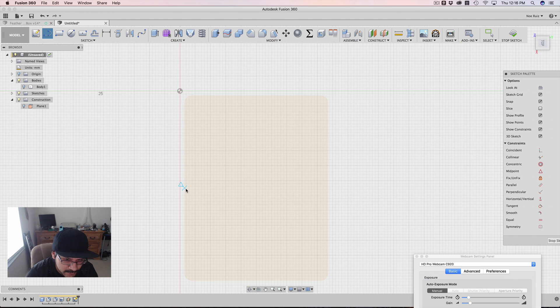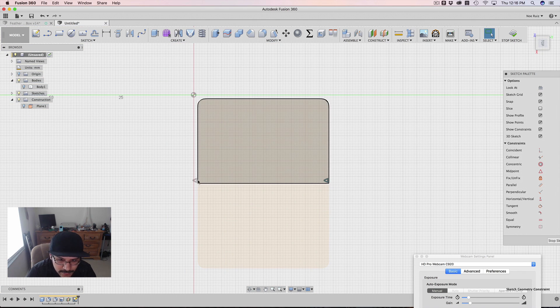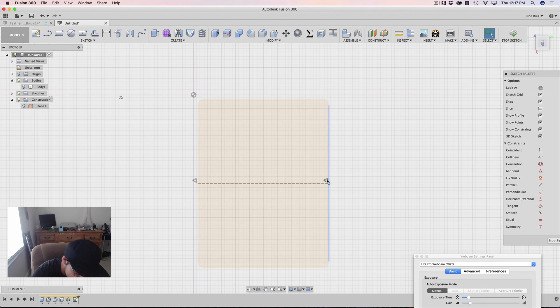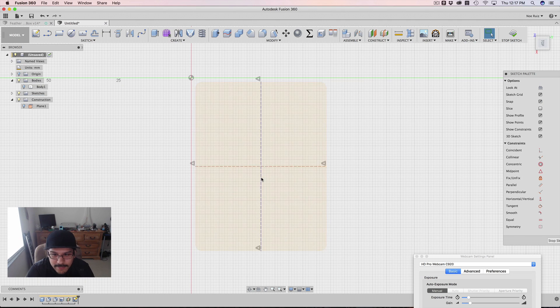It locks into place and gives you a little playroom. Once you see the triangle, that lets me know it's a midpoint. I'll click on that point and move my cursor to the next midpoint, hit okay, and now I have these two triangles. These icons let me know I'm in the middle. No matter how I try to move this, it's locked into the center. If I ever update the enclosure, these lines will adapt with it. I'll hit X on my keyboard to make it a construction line so it's not intersecting anything, then do the same thing vertically. Now I have my corner construction lines set up.